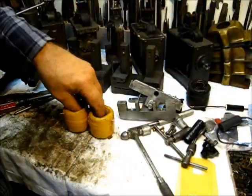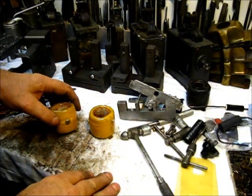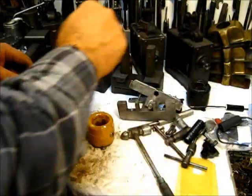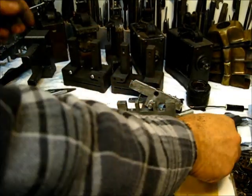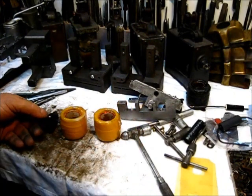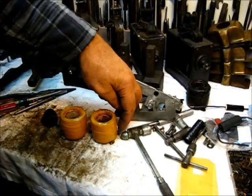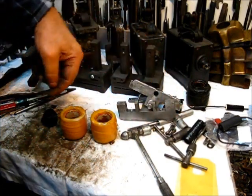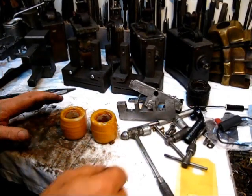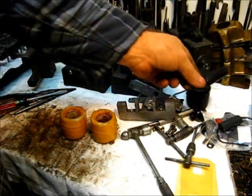When you put this in there and assemble it all, these are to the outside. Whichever side you put the spark plug wire on — let's say this side — then you have to ground this side. That's what that ground inside that cover does, so it makes a circuit right there. That's the reason for that little thing. The original condensers would have had that cover on them for protection.